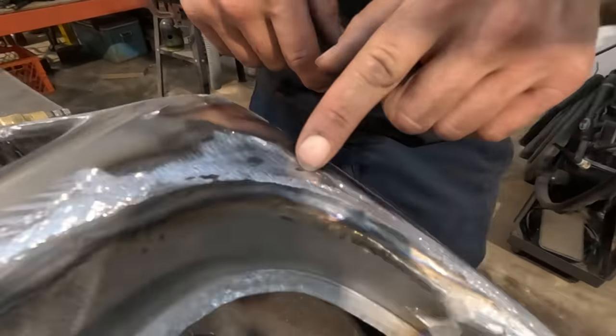Okay, so that's just a bit of 80 grit again. This is just 80 grit on the DA. The reason I like 80 grit is that it's harsh enough that you can take welds off with it, especially if you're using Cubitron, and it's also kind of smooth enough that it's as far as you need to go for somebody to want to prep for bodywork and paint. Like 80 grit is kind of perfect.